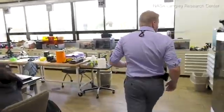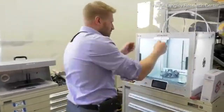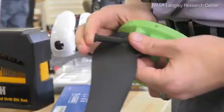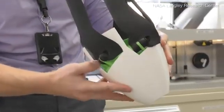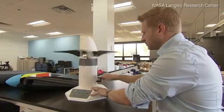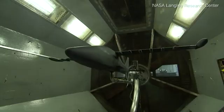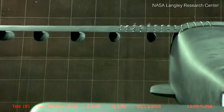There are a few different ways that we try and test out various models to get an estimate of the performance or the behavior of the aircraft. One of my favorites is using 3D printers to make prototypes of individual components or assemblies, so that we can learn things like how the assembly might go together or how the dynamics of the system might behave. Another thing that we've done is to build wind tunnel models of the nacelles, propellers, and even a full vehicle test. What we learn from that is to get detailed aerodynamic data on real world parts.